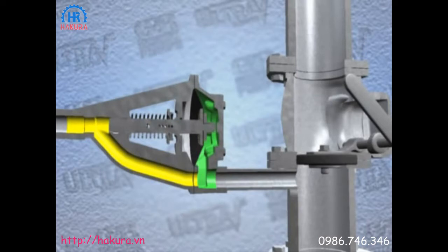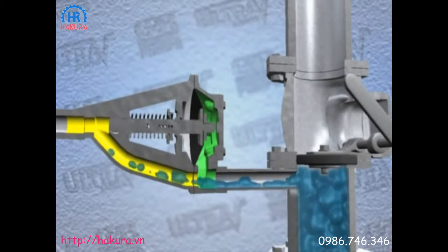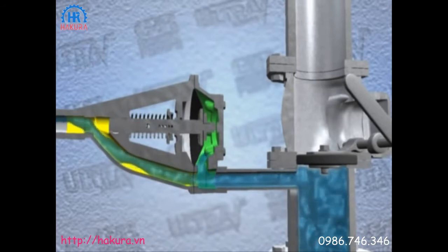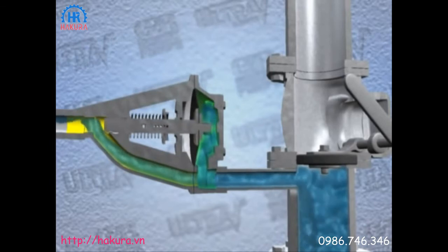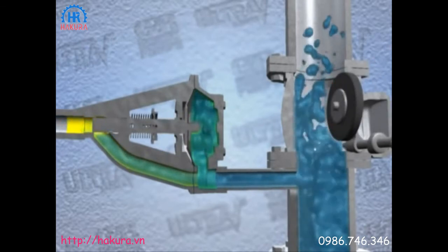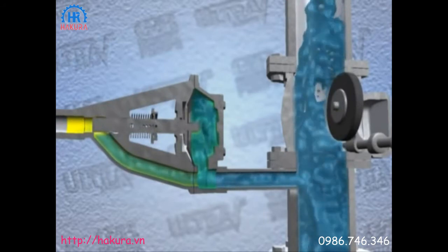The air release valve is installed between the pump discharge outlet and a check valve in the discharge piping. During the priming or repriming process, this valve allows any air in the pump and suction line to be vented and returned back to the sump. As the liquid rises in the discharge line, it fills the back side of the valve. The pump builds pressure and causes the air release valve to close, shutting off the passage on the discharge side of the valve.